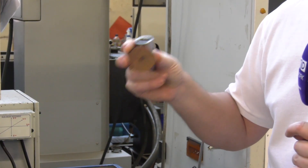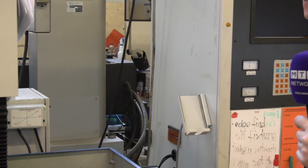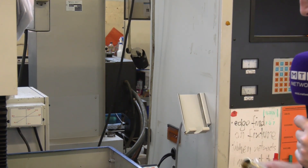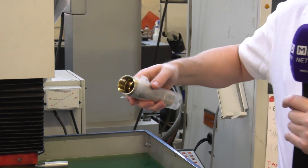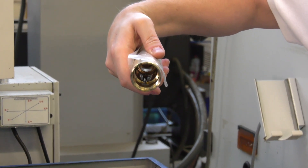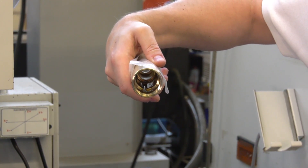That would be really hard to machine, so you'd use an electrode like that to get that finish. The next one is what's being machined at the moment - I'm assuming it's quite a large component on a fixed head. Inside here it's got a keyway going to a blind finish, and that's what's being EDM'd at the moment - a great example of why you use EDM.